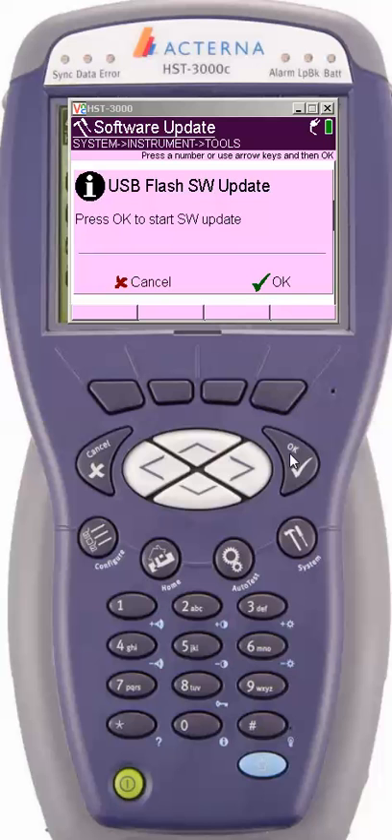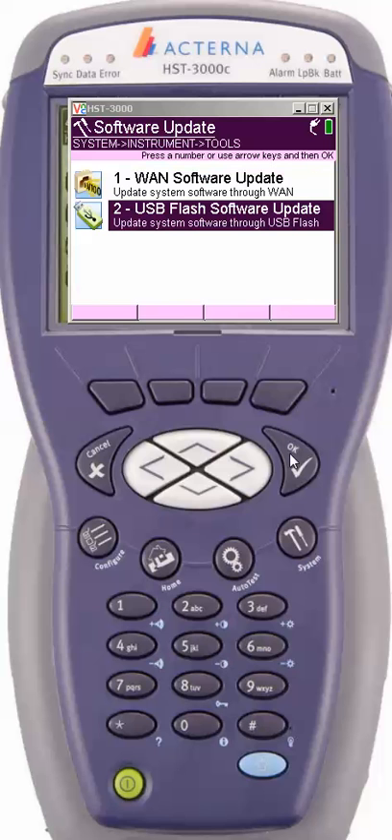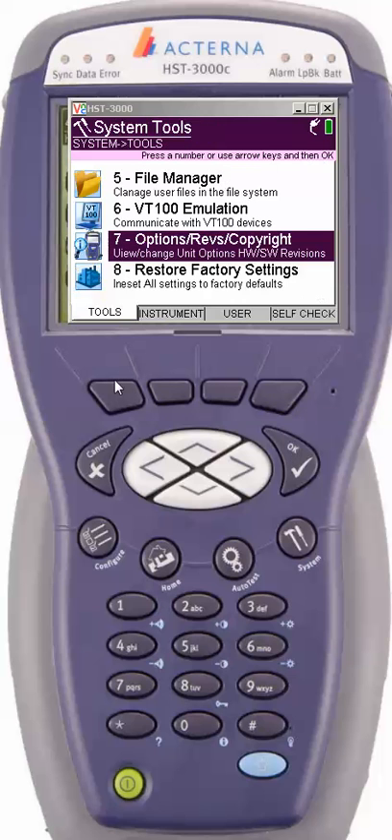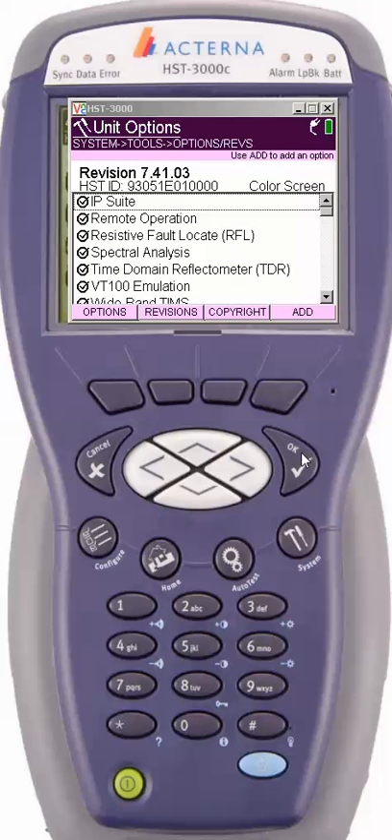Real simply, just hit OK. It takes anywhere from 12 to 18 minutes or so to actually perform an upgrade. The screen gets real small and you'll see a bunch of codes flying across the screen. Once the firmware is complete, the meter will shut itself down. When it shuts down, you turn it back on. You can go back to the tools, go to Options and Revisions, and verify what revision you have to make sure the new firmware update has actually been applied.